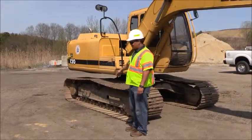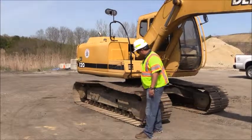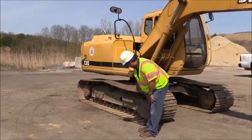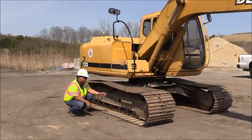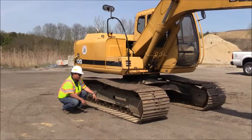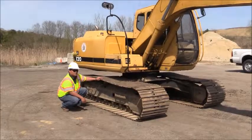As part of the inspection process, you want to check your tracks. Make sure that there are no broken tracks and that they've all been maintained. There's also a chain that runs along — you want to make sure that the top layer is clean of debris. Make sure you don't have any mud or debris anywhere on your track, then check it for durability and wear and tear.